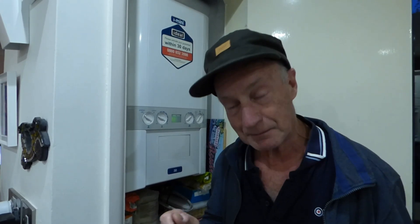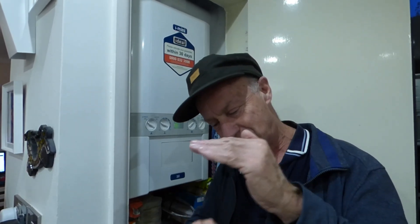If that has failed, there is a workaround: you drain the system a little bit and use an upstairs radiator in a bedroom that's not often used. What you could do is drain some of the water out to the level of the top of that radiator, then drain a bit more out via the drain valve so it drops the radiator level down to about a third. Then fill the other radiators back up and re-pressurise, but don't fill the room that has that radiator you've allowed to drop. You're essentially going to use the air in the top of that radiator — the top five to six inches — as an expansion vessel to do the expanding for you.